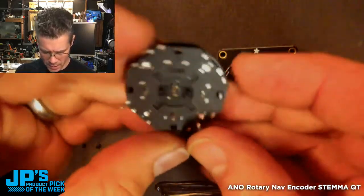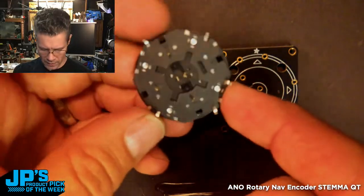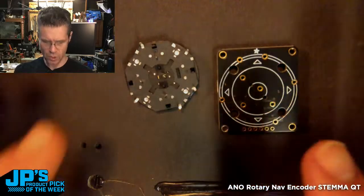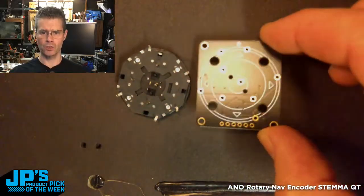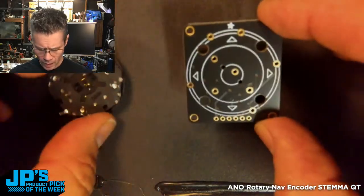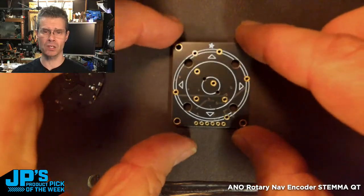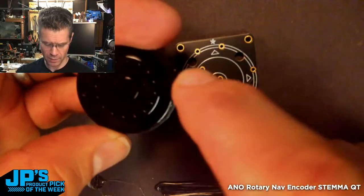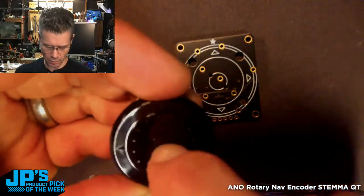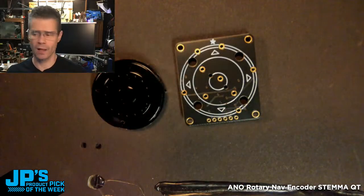But these right here have, as Lydia said, an unusual pin layout. You can't really fit that onto any kind of breadboard, so you're stuck having to wire this in the first place. So that's one use of the breakout board. However, besides just getting this wired, there's interfacing with it. It has a lot of pins. It uses 5 different pins just for the up, down, left, right, and center buttons. And then we have a few pins used for the rotary encoder as well.